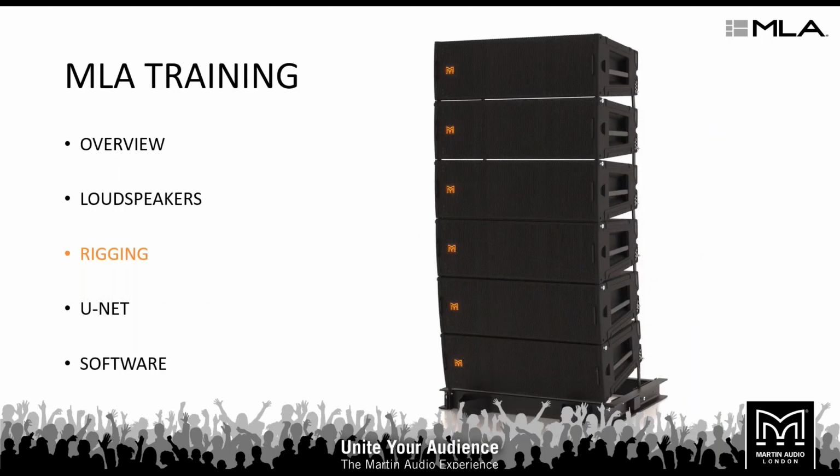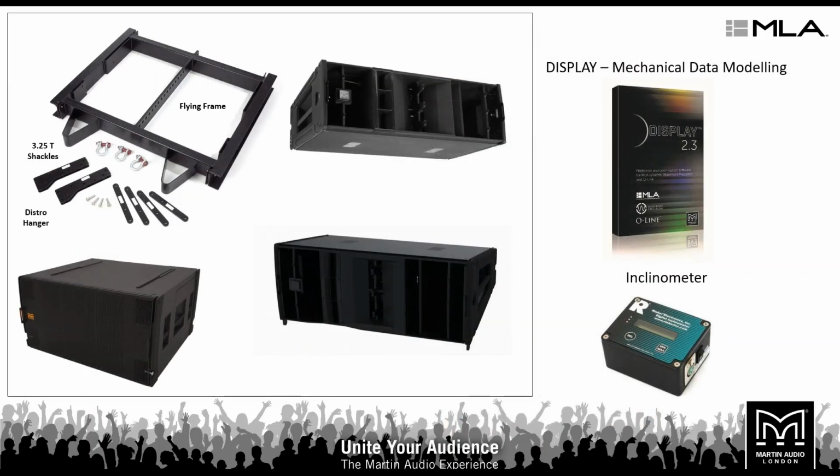Okay, let's have a look at rigging. So, of course, we have all of the standard hardware that you would associate with a touring system. Ground stack bars. We have a distro hanger which attaches to the back of the flying frame, so that you can attach the socket for the power and network and signal. It's important to mention also that in our display optimization software, which I would highly recommend looking into if you haven't already, there is a rigging report which we can export, and this gives us all of the angles that we require to deploy our system in the most useful way possible.